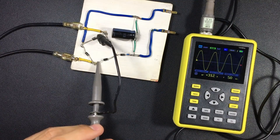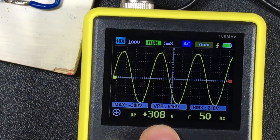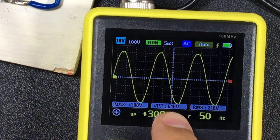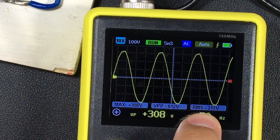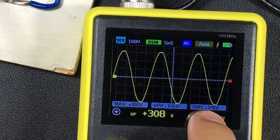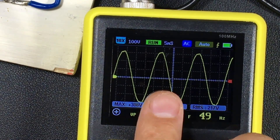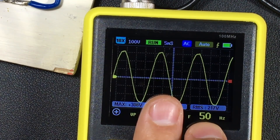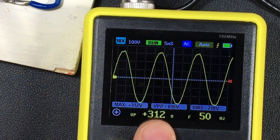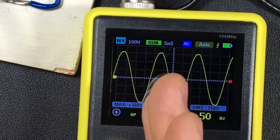Notice the values — pay attention. Peak voltage: 308 to 312 volts. Peak-to-peak voltage: 612 to 620 volts. RMS voltage — which is what you knew until now — is almost 220 volts. These are the voltages you already know: 220V and 50 Hz. But there are also these other voltages we now need to know for electronics. Only an oscilloscope shows us what happens through time.